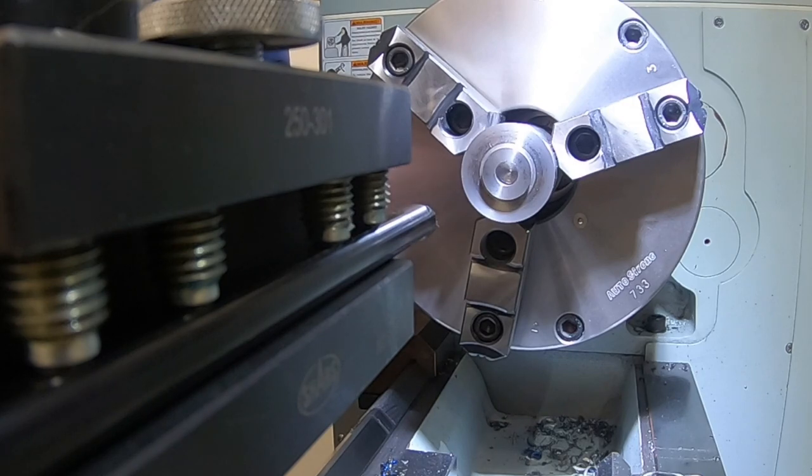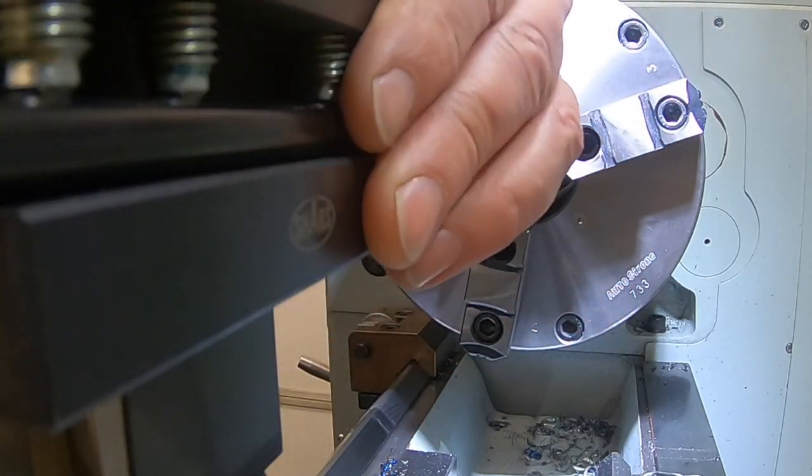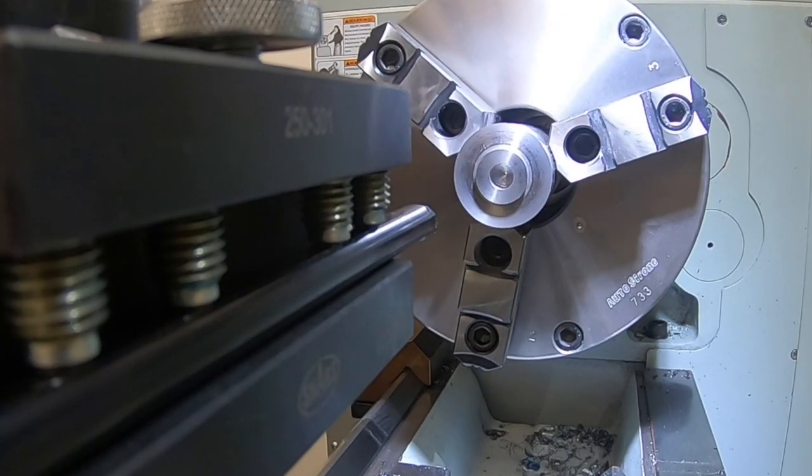And that should be about 1 thou cleared, so maybe a little snug on the shaft. We'll have to see when we're done. We'll get in there and clean it up a little bit with some emery after if we have to, but I think that's going to work. Definitely tighter than we had last time around. Oh, while we got this on there, let's go ahead and put our bevel in there.